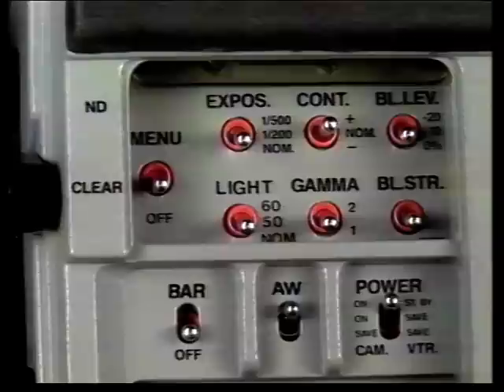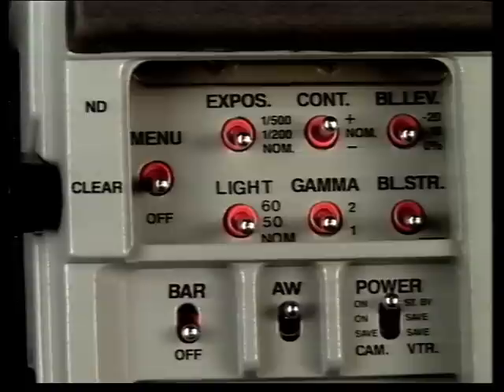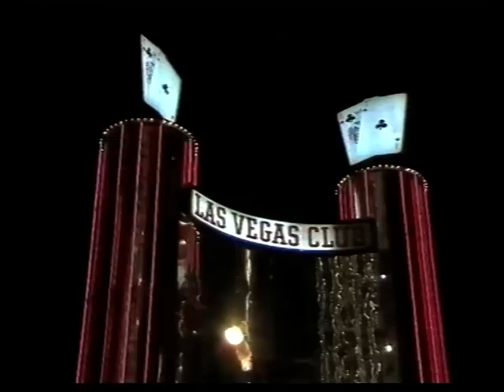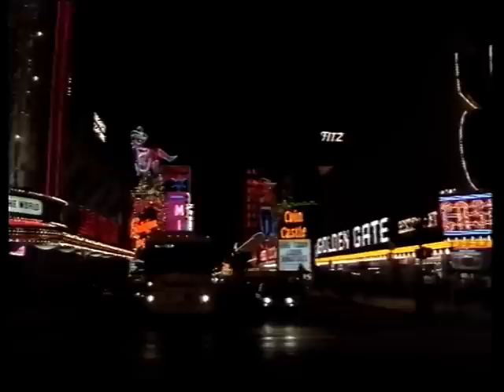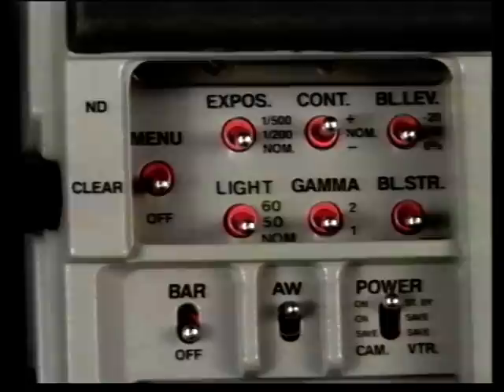Finally, the menu panel also includes a unique lighting switch. The settings that are provided — nominal, 50 and 60 hertz — enable slow and 10-cycle variations between the lighting and the TV system frequency to be minimised, particularly when shooting in TL or HMI lighting, or when shooting 50 hertz pictures in 60 hertz countries or vice versa.